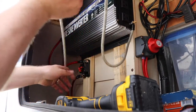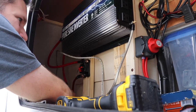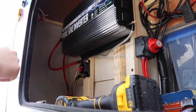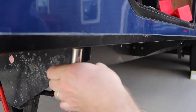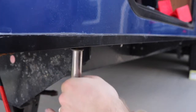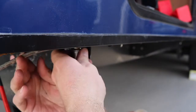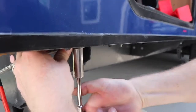Now that we've got all our wires run, let's route this one above that to help run the wire a bit better and keep it up out of the way. Now we're going to make our connections at the front of the trailer. We'll hook our chassis ground up first — there's a convenient bolt right here near where we came down. This bolt has a nylock washer so we don't have to worry about it coming off. Then we'll suck up some of the excess back into the trailer.